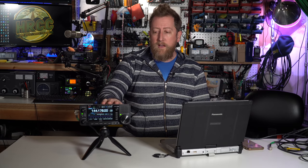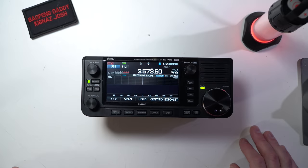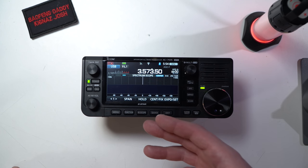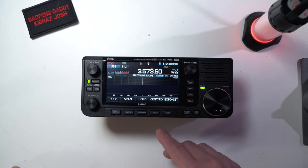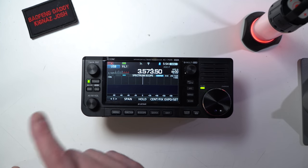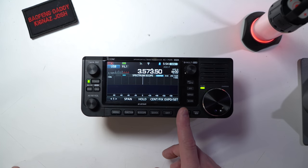With that tool, you'll be able to log in basically to the server — the user server that's running on the 705 — and that allows you full control of the radio. Our goal today is to configure a remote connection server mode, and then depending on what kind of connection you're on, either connecting to a wireless access point that already exists, like in your home, or make this the access point for your computer to connect to it directly.